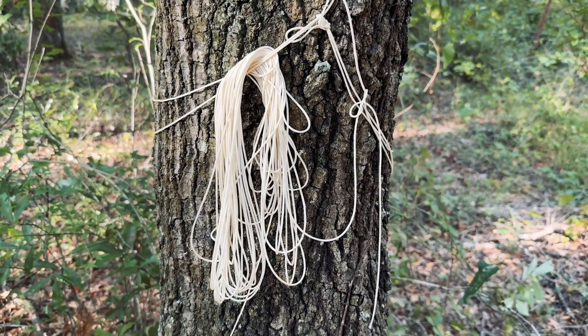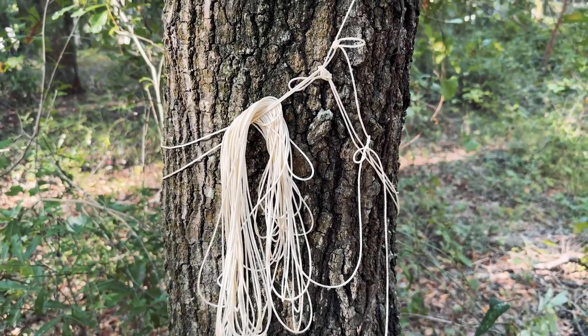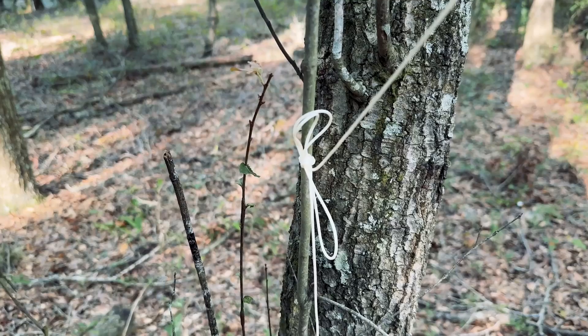Now that I've untangled all the pull-up line, there it is just nesting there in case I need it to take the antenna down at some point. And there is the pull-down line, just tied off a little bit in case I need it later. Now it's time to put up the last line for my dipole. I'm going to do things a little differently for two reasons. First, I know I have power lines in this area — to the south across the street and to the east on the other side of my house — so I'll only be shooting either to the north or to the west, away from the power lines. Secondly, this is going to be right in the middle of my front yard, so instead of using white cable, I'm going to use a hundred feet of paracord and loop it so it'll be one continuous loop with a pull-up and a pull-down.